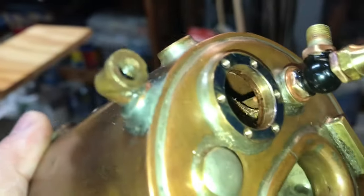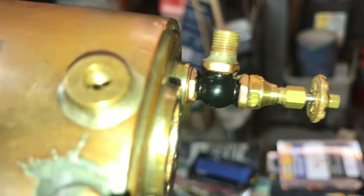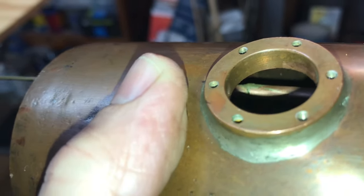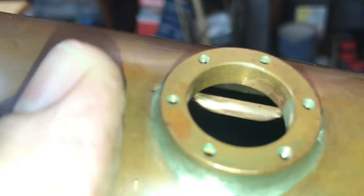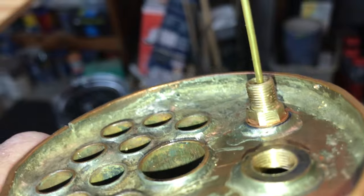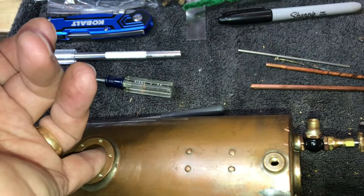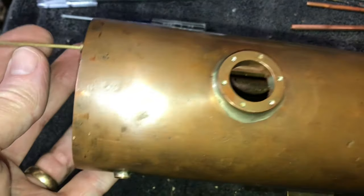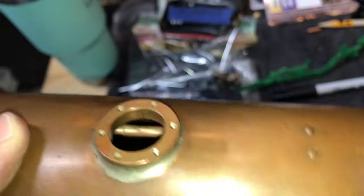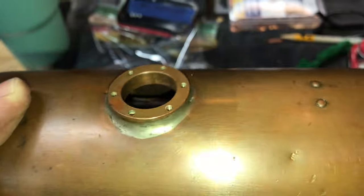I'm really happy with how that came out. I've got the little blower valve cranked all the way over and I think I'll leave it just like that — I looked at some other pictures and they had them just like that also. You can see the line inside there, you can see the part that's silver soldered. That's exactly as I planned — to put the thicker portion right in the center where I could reach it with my fingers. I've already got the outer fitting for the blower tightened up with its little copper washer, and it's nice and snug. The length is just perfect — if your boiler is the same length as this, then six and three quarters is just right. I used a little rod to help orient and guide the tube into the right position. I'm going to take it apart and let it sit in the pickle overnight to make sure the blower tube is absolutely clean, and I can double check the soldering job.